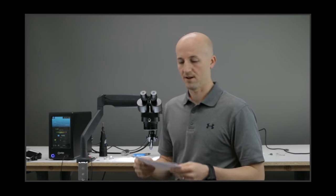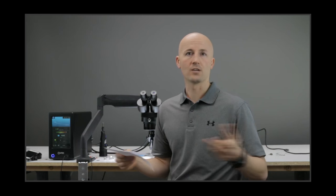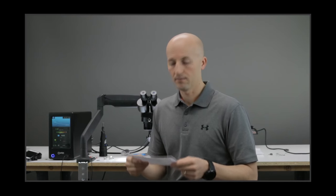You saw in the video of Bryce with that close-up video — he had his fingers really close and everything was fine. You can also use the welder to cut your wire. If you don't have cutters, you can touch the electrode up the wire a little bit and pull and it'll break the wire for you — especially on 30 gauge and 28 gauge wire, that'll break really easy. On 26 gauge and lower, you probably have to cut it with cutters.